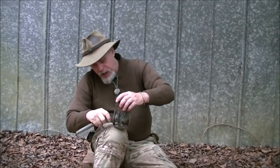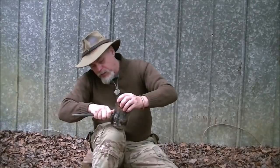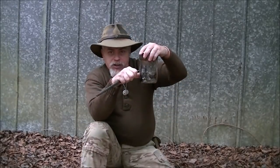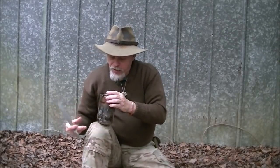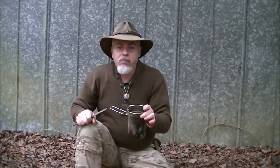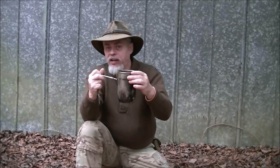What are you going to mark on the steel with? You need something harder than steel that's going to cut steel. They make scribe pencils you can get at the hardware store for marking your tools — they work really well. But if you're down and dirty, a file works. That point on the tip of a file is hardened and harder than steel, and will scratch steel. Most files have a sharp corner or point that will allow you to do it. Measure down on the outside, bear down, and scratch forward and back along a line. If you want to make it neat, put a piece of cardboard or duct tape there as a guide and scratch back and forth until you can see it. Likewise on the inside, come down to the measurement and scratch back and forth. Leaving the water in it, come up right at water level and scratch on the inside. That will give you a one-cup measurement and speed up your measuring.